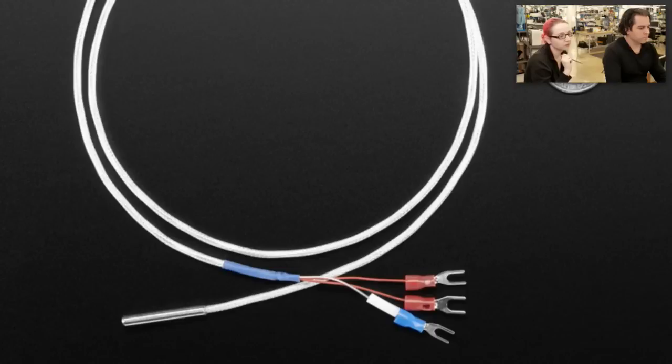In comparison, this type of sensor — which is a platinum 100 ohm sensor — is very precise and very accurate. This is almost like the standard method of measuring temperatures when you need high precision and high accuracy.